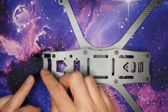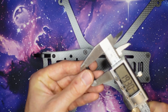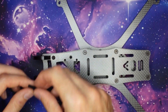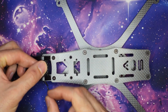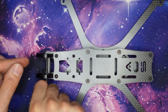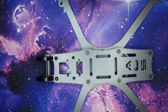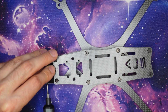The final step is to install a 23mm standoff across the top of the camera cage for reinforcement. Make sure you double check that you're using the 23mm standoff because you may also have a 20mm M2 standoff in your kit and they look pretty similar. You're going to want to install this standoff using the long M2 button head screws — these are M2x10. Just run them in with your fingers on either side before doing them up with a screwdriver. Again you're threading them into aluminium and they're only M2 so don't apply too much torque — you just want to make sure they're nice and snug.